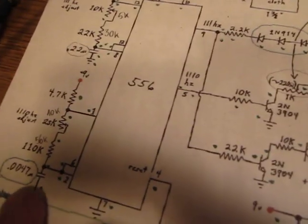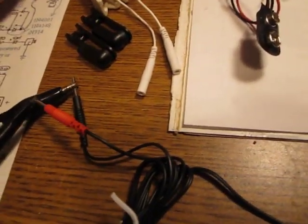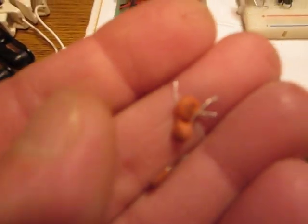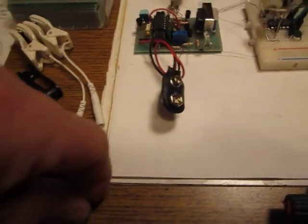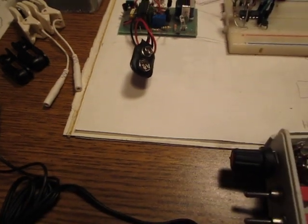And these two capacitors have to be good capacitors. I tried before. I bought a couple hundred of these ceramic capacitors, and they are useless here. They respond to slight temperature change, and even if I was holding a PCB and touching a capacitor with my fingers, it would cause fluctuation of the output frequency up to a couple pulses per second.